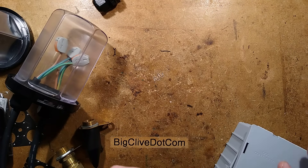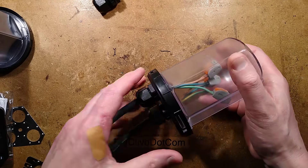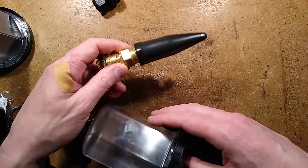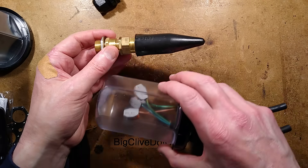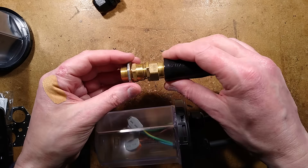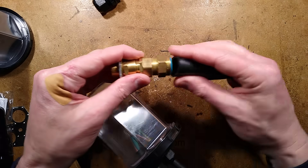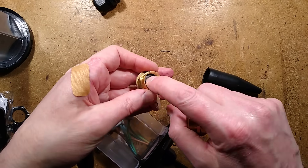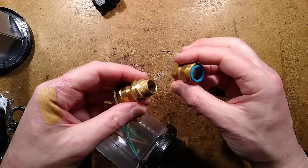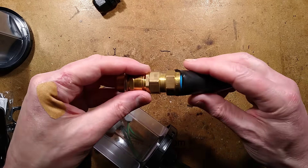The subject of this video is from the same stable — it's the capsule version, designed for outdoor use with proper waterproof connectors. How waterproof the connector is will depend on the rating of what you can do with it — whether it has to be mounted out of water or underground. This particular one is water resilient with seals, including a little seal for the cable and an external cable grip and another seal for the wire armour, but it's not rated fully for submersion.